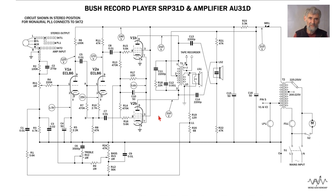We've had similar units to this, but with this one there is a stereo conversion using the external amplifier for one channel. This here is their interpretation of a cartridge — it's a stereo cartridge with some extra wires. If you just buy the record player, where it says PL1 there is a link that plugs into the amp input. By doing that it monos it by joining the two channels of the cartridge output together and one has it as a normal record player in mono.